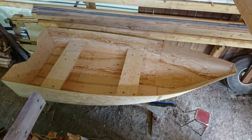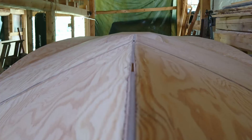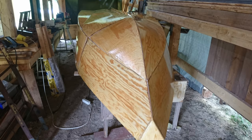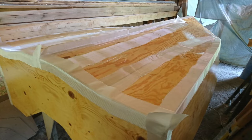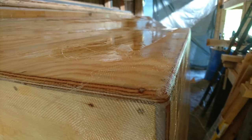When all the epoxy has cured you can remove the metal brackets and start the sanding. Sanding is not the most fun thing in the world but if you want your boat to look nice you need to do a good job with a sander. When all surfaces are sanded smooth you can apply the first coats of epoxy. The plan is to coat all surfaces of the wood with epoxy to make the boat completely waterproof. Here I'm putting fiberglass strips on all seams in the hull — the fiberglass makes all joints very strong.